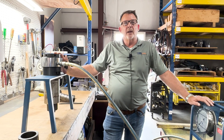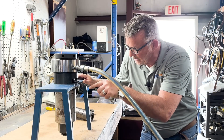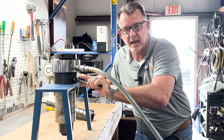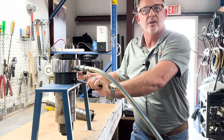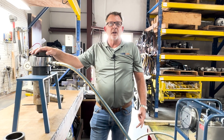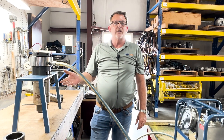Once you've achieved the correct pressure on your pump, you would then take your tommy bar, put it in the tommy hole of the socket ring, and just nip down. Once that's nipped down, nip all the rest down on the flange, and that's your load captured. We take the pressure of the tools up three times and then just turn the nut down each time to ensure you've captured the load.